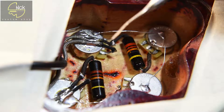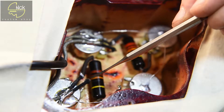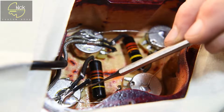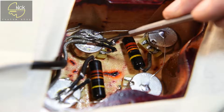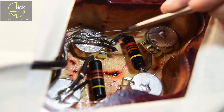Let's review. Solder joints have a nice fillet between the terminal and the wire. Excess solder running down the legs of the potentiometer has been avoided. We've got very good penetration of solder on the braided shield without having big bubblegum buildup.